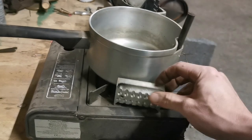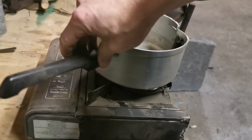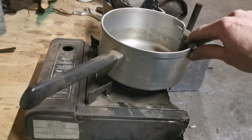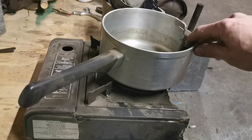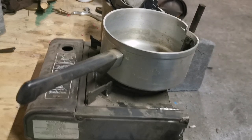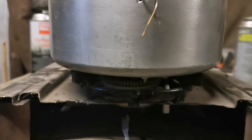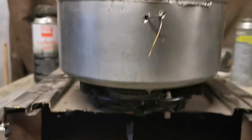If we put the pot on the heat, you can see that this edge can sit out slightly further. I've cut a small piece off this old stove, but if you can do that it allows this to sit out, and because it sits out it means we have room to get our mould in below, which means we never have to take the pot from the heat — which is a vast factor in getting steady pours of your lead.